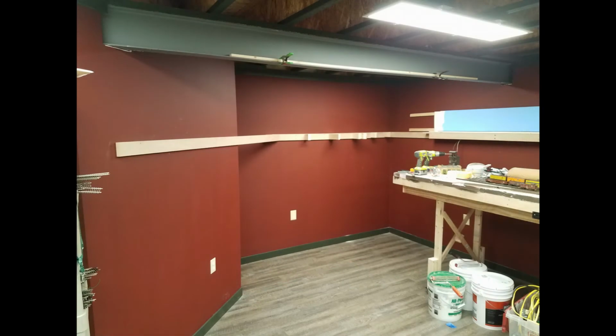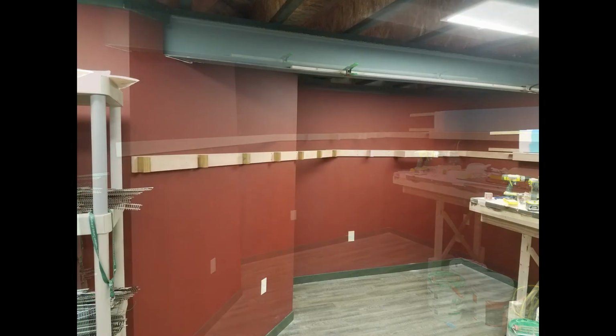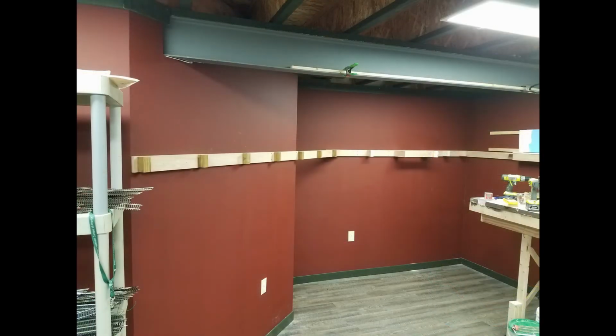The next step was to temporarily mount the stringer for the Hudson grid. You'll note that part of it's hanging in the air, not attached to a wall. The far end is attached to a cleat on the other stringer. You can see that the near end doesn't reach the near end of the wall. Part of the test fit was to measure for the piece that would extend to the near corner. The next day I added the extension piece and attached joist cleats along the entire length. Then this stringer too was permanently attached to the wall.